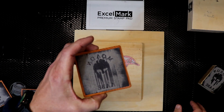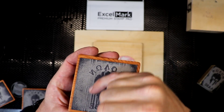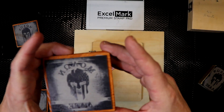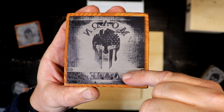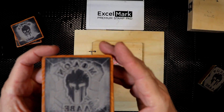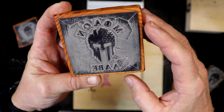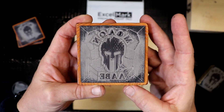Here is the first stamp I did — it left a bunch of extra rubber while etching, so all these extra lines right here should not be there, just the helmet. I figured out what that problem was eventually. The second one I turned to etch in a different direction but it did the same thing, leaving a lot of rubber around the letters. I did another one with offset fill which came out better — burned away all the rubber I needed — but not quite deep enough. I wouldn't sell it because the look isn't clean enough.